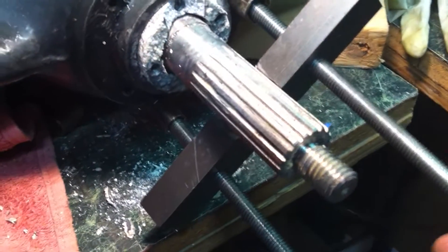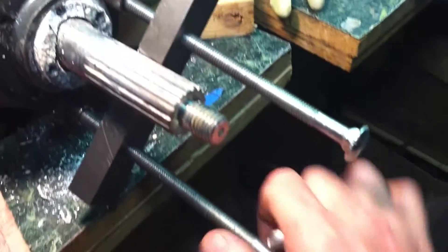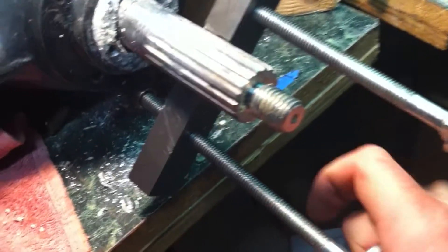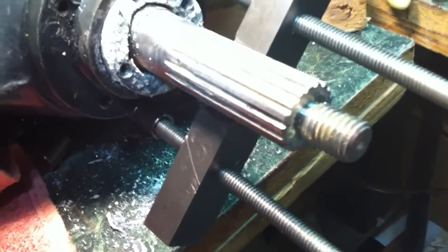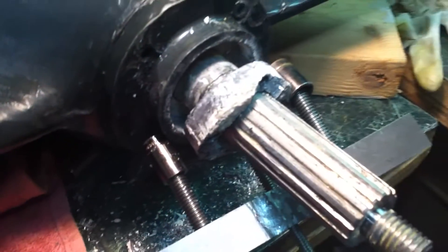Here it is coming out — almost at the end. Just turning the wrench and you can see the zinc is now almost all the way out. You can see on the side there how much it's moved. I can kind of do this almost by hand now, and it should pull it out the rest of the way. There it goes — one zinc pulled out. That's how to get the zinc out of the drive leg on the Gemini.